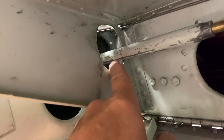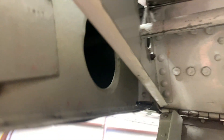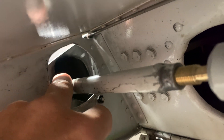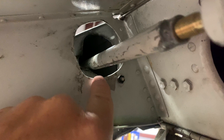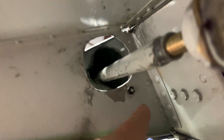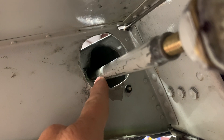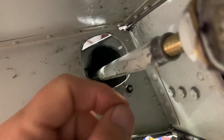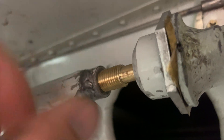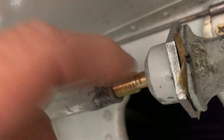You can see everything is okay when the flaps are down, but when I put the flaps up, the aileron itself has been cut out — it has a hole in it. Right over here in this corner, you'll notice the metal is all busted up. When the drooping mechanism has pushed the ailerons up, this thing ends up dragging on that metal. You can tell because all the paint is gone off the end of this rod. The aileron is just sitting here rubbing up against this piece, and it ends up snapping it off.